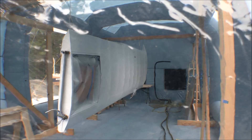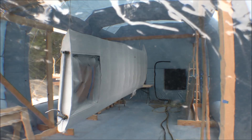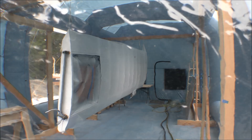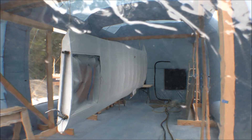I got the paint yesterday afternoon, so I spent the afternoon getting ready to paint. I had to dig out my breather setup. That first stuff I was spraying - the poly brush, poly spray, and poly tone - that's all liquid vinyl. The carrier solvent in it is pretty noxious, but everything forms pretty good-sized droplets when you paint, so I wore just a regular chemical-type respirator with a carbon filter. But this paint I'm putting on now is a polyurethane paint, and that's got polyisocyanates - basically superglue. That stuff forms really fine particles, it'll go through a filter, and it actually bonds with liquid moisture and will glue the tissue in your lungs together. So even a regular filter won't filter everything out.